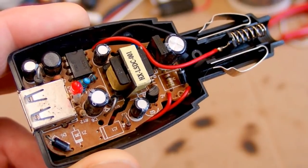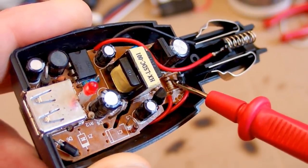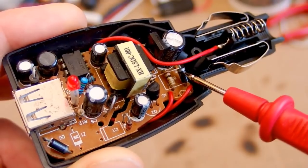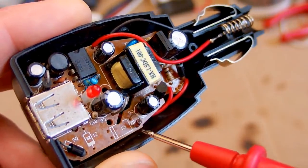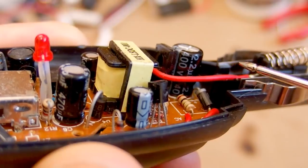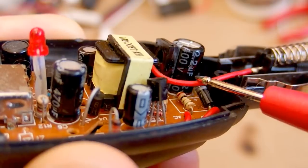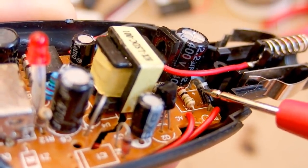And this charger apparently went through some cost cutting, because on the board there is a space for a bridge rectifier, but there is just a single diode. And there is also a space for an optocoupler, but there is none. And this primary smoothing capacitor is just 2.2 micro, which is not much, especially given that it's charged using just 1/2 cycle.